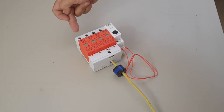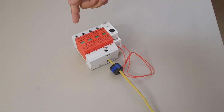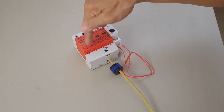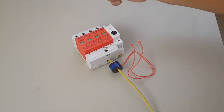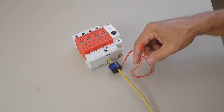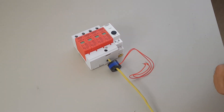If you have a surge coming in at the input of your surge protective device, the current will go through the varistor built inside and will be directed to the ground wire. This is actually quite perfect if you have multiple phases — it doesn't matter which phase the surge comes in on, because at the end everything goes through the same ground wire. This is cool, and this will also be the way we install it.